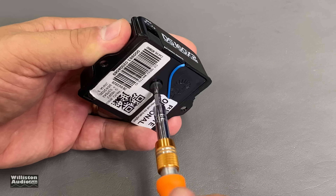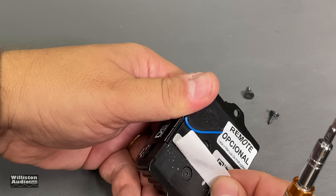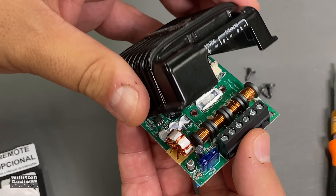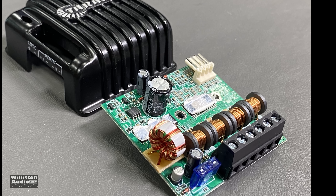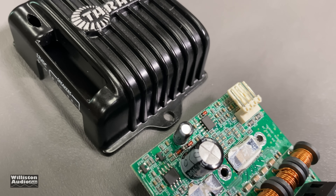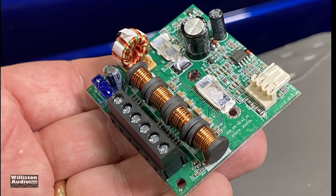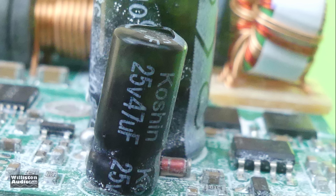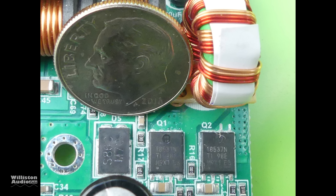Using our favorite screwdriver kit — check the video description, you can pick up one of these off Amazon. Three screws on the bottom of this amplifier, then you pull the little bottom plate off. You can see the bottom of the circuit board — it's really difficult to portray size but you can tell it's in the palm of my hand. These caps: 470 microfarad, 25 volt — just so small. And this one: 25 volt, 47 microfarad — literally here's a dime to give you an idea of how tiny these components are.